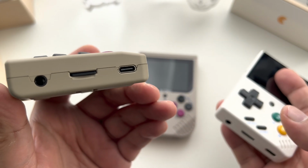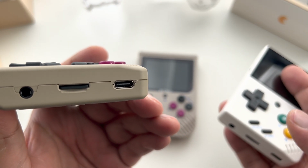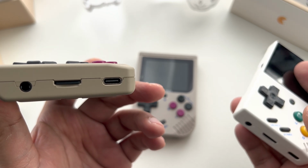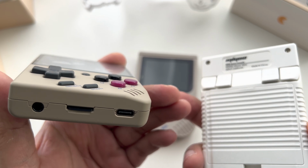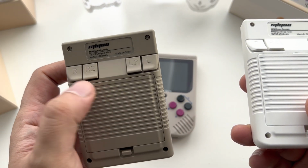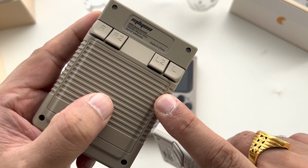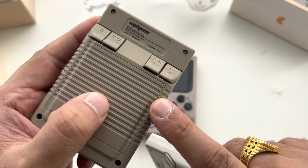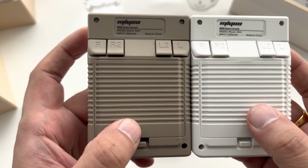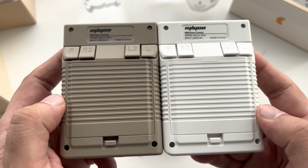data port, which sadly the Type-C port is only used as charging. It doesn't carry data. We've already determined that and checked it. So that's a bit disappointing, but it doesn't stop someone from modding it later on, and maybe connecting the Type-C data port to the data lines in the device. Pretty much doable. We have distinguished there are pinouts inside on the board. In developer terms, it's called UART, where you can debug the device and do other things. So that's pretty handy, and they are quite easily accessible from the board.